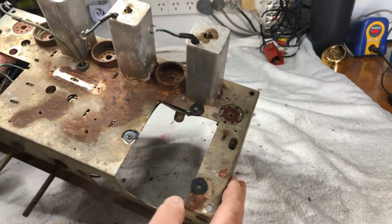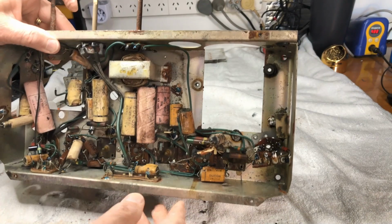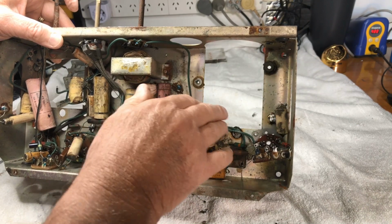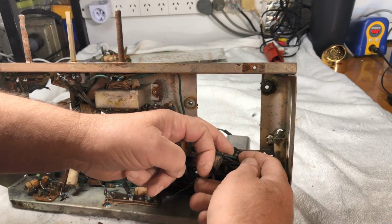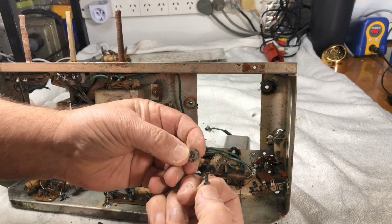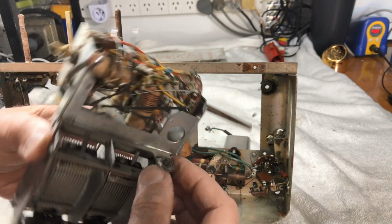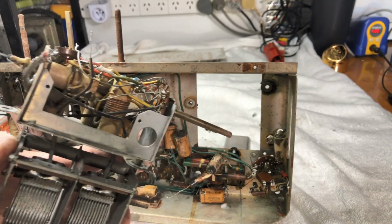This looks like it needs grommets, I would say. They're pretty hard. Underneath makes the job a lot easier with these caps here and the resistors here to get at. So we'll update all this, put new grommets in him. These also have little spacers in them. This back one is the one I cut off. We'll get onto this fella. There's a spacer still in there, and it's solid. So we've got to clean up the dried rubber. All right, we'll go from here.